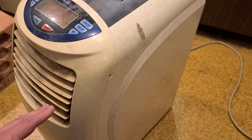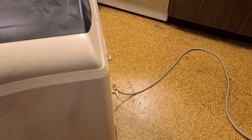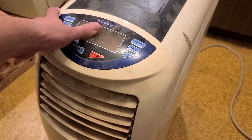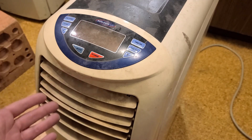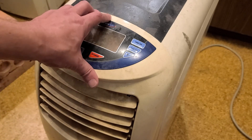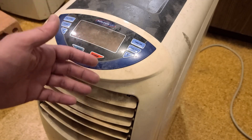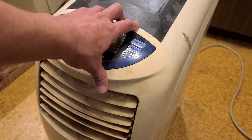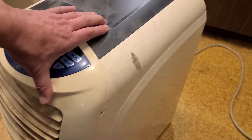You won't find heat pump air conditioners in anything less than about 10,000 to 12,000 BTU — anything smaller is air conditioner only or has resistive heaters. You want the heat pump. Even though this is a single-tube unit, it's still a lot more efficient than an electric heater. A heat pump is actually cooling the outside air — it's literally like taking a window air conditioner and flipping it around backwards, taking warmth from the outside air and moving it inside. In the 40–50°F range these can be three times more efficient, putting out three times the BTUs.